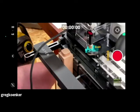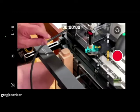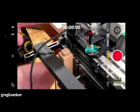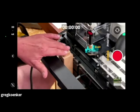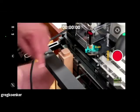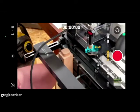Usually what I do is, let's say I'm doing a 1/2 inch cut and I'm using a 3/16 inch diameter bit. You can't quite do it in 2, but what I'll do is make them equal cuts so that each of them is a little easier, and then I'll do a final pass as a cleanup. I'll do things like that sometimes.